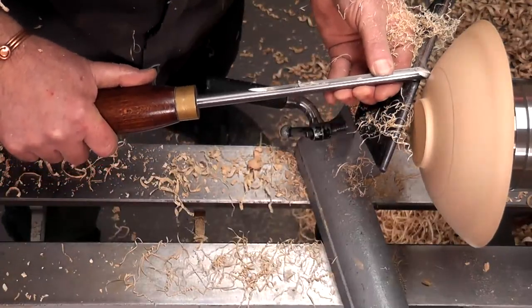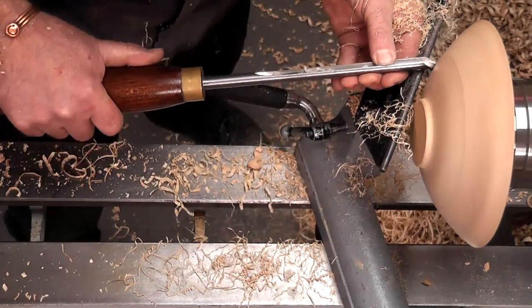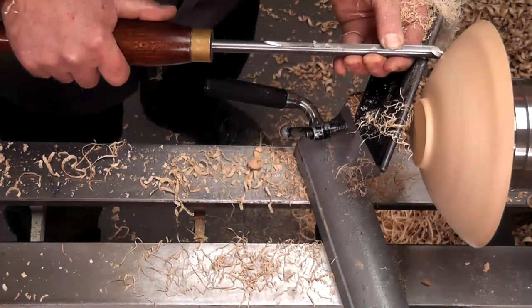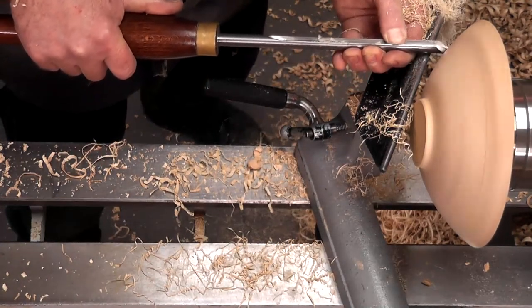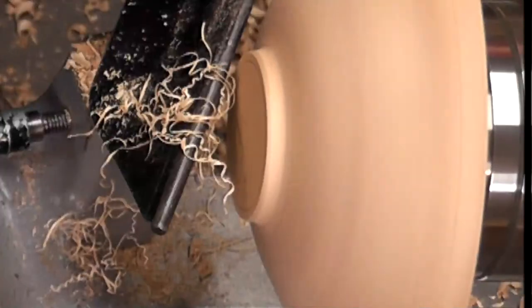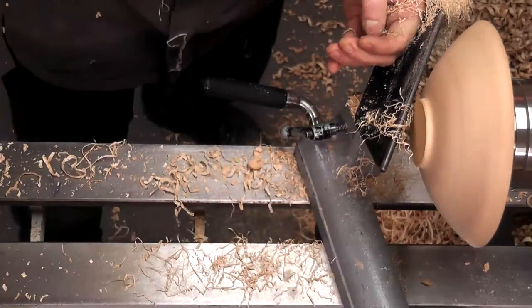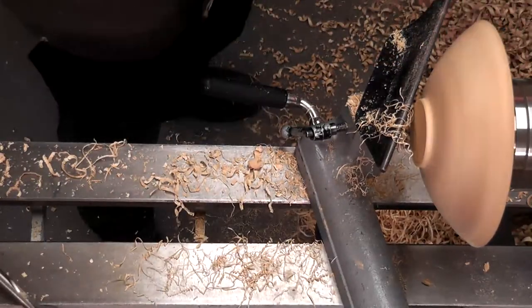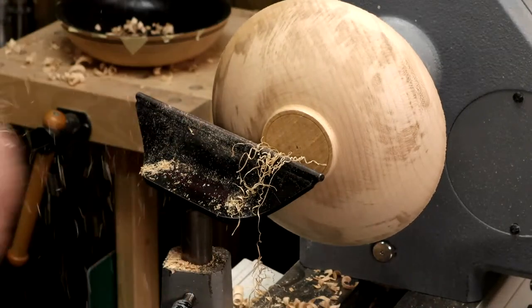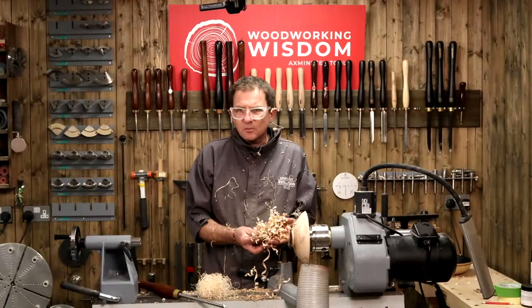So before I came on, I sharpened everything, set that grinder set up. Used the Wolverine setup we used the other week. Just taking a really light little cut up round here now, just to pull that shape in. I'll show you what I mean by light cut, just in a second. Let's get to there. Okay. This could be a bit interesting. It's leading off my bowl a little bit. I think, Rich, could you just get a two or three for me? Look, let's look at these.